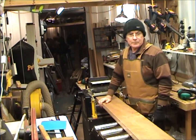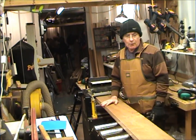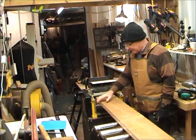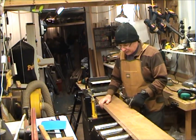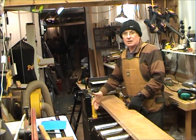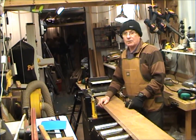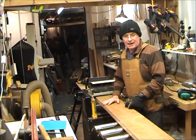We've got the plank down to a manageable size. Well, it's 12 foot, and this is the longest plank we'll be putting on the starboard side, and we're now going to plane the surface down. What I can't seem to be able to buy locally is 33 or 32 millimetres thick. So, this one's 40, given the length of the board that seems to come up thicker, and I only want 25. So there's quite a bit of work involved in getting this down.